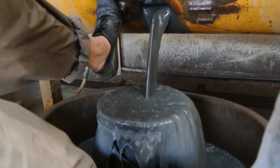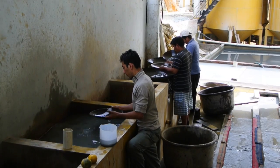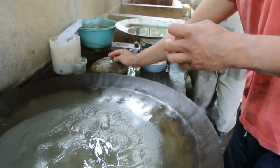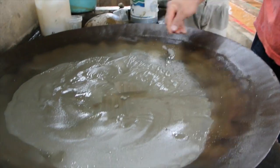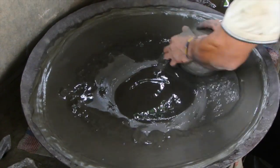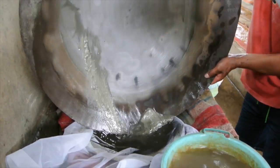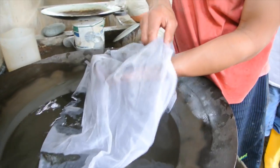After processing in a chancha, or collecting the concentrates loose, the next process is panning, followed by amalgamation. Artisanal miners will work for 8–10 hours panning their material, reducing its size tenfold. The best panners can retain 90–95% of the gold. The remaining 10–15 kilograms of concentrate is then further ground with a stone. Grinding the ore further decreases the particle size and increases the chances of mercury forming a bond with the gold. After 4–6 hours of fine grinding, the gold is ready to be separated from the ore by filtering and rinsing through a cheesecloth. At this stage, the gold and mercury will form a metallic putty known as an amalgam, which is captured in the cloth.